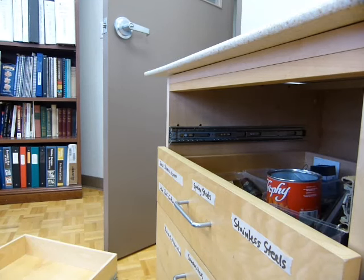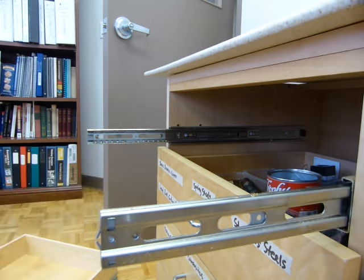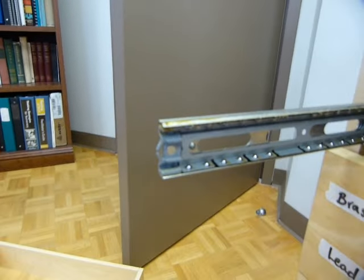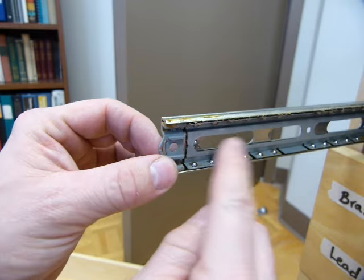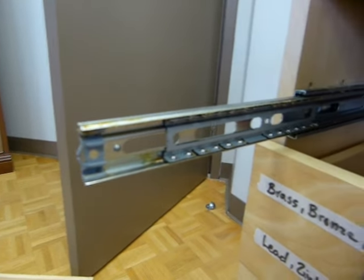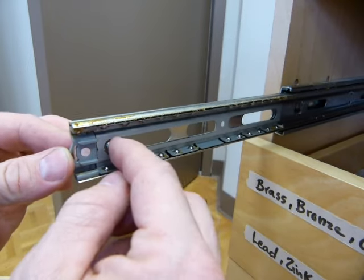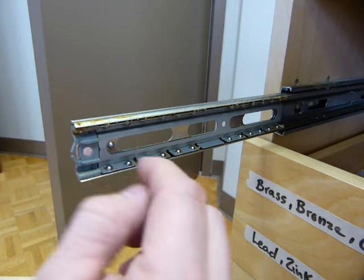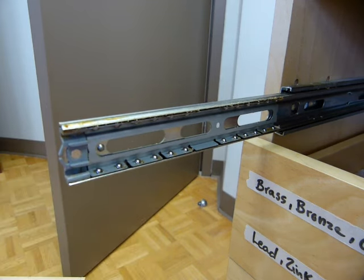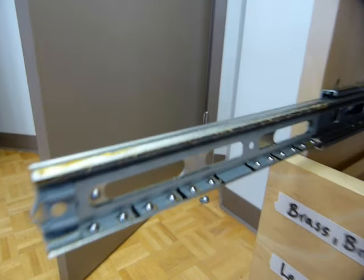I'll show you how you can install and remove a drawer from these drawer slides. Many of them have a very similar design. You'll see a bunch of bearing balls that slide on a piece of sheet metal — because they are all tied together, they all slide and glide together. It's important that you start installation from the point where it's all the way out. Usually at the end of the drawer slide there's a plastic clip, same on the other side too. It's also greased and lubricated — you can see some of this yellow stuff.